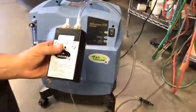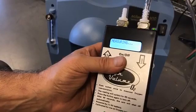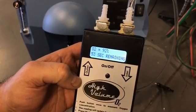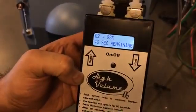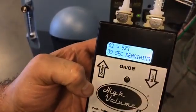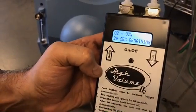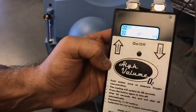We registered up to 92% for a second there. Sometimes it takes a little longer to get up to purity, and with the heat the purity can be a little bit lower — summertime purity. This is looking pretty good at 92, it just hit 93. You'll find really varied numbers. If I had a bank of six refurbs, I would go through the bank, test every one of the machines, and write on the machine what it's doing. You can get six different readings anywhere from 70-something percent all the way up to 92%. It's really important to know what your machines are putting out.